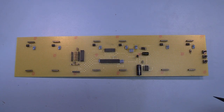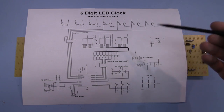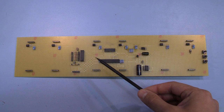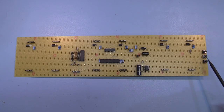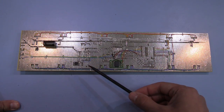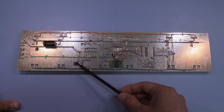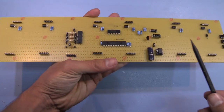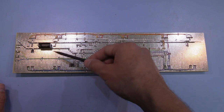I've completed soldering everything onto the board — it took longer than hoped, so this is now mid-week. I've drawn up a schematic which I'll link below and write up on my website. You can now see all the components: the microcontroller, a couple of capacitors, a 3.3 volt regulator, switches for setting the time. On the other side there's the bulk capacitor for the 12 volt supply, the temperature-compensated crystal oscillator, and a header for the RS485 connection to the GPS disciplined oscillator, along with an RS485 transceiver.